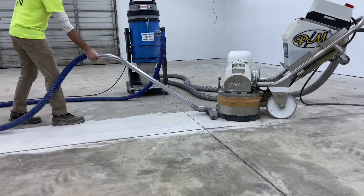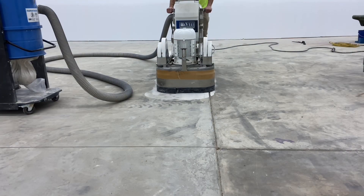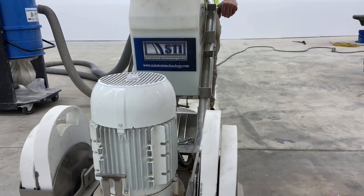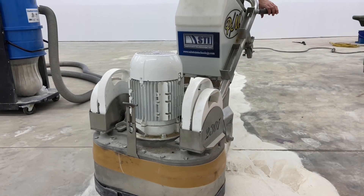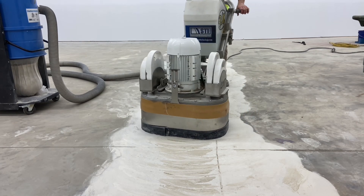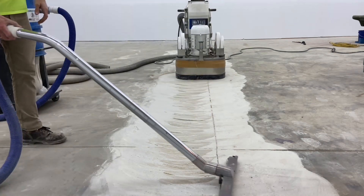The objective is not necessarily to make the floor completely flat, which would take much longer and be a much more expensive process — and quite honestly, for a coating, it's unnecessary. The goal is simply to reduce those abrupt elevation inequalities that would be wear points for traffic. The floor will also look better, as any light reflection will appear more orderly than if the floor were wavy.